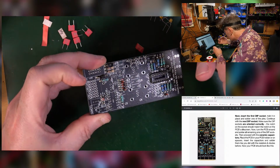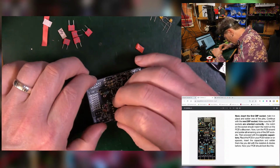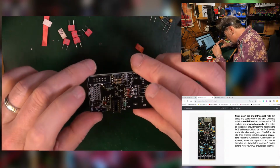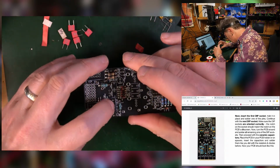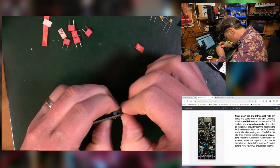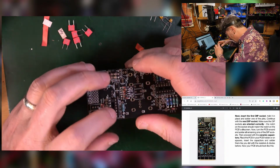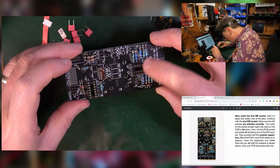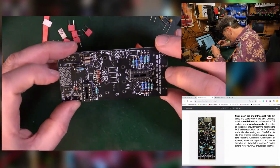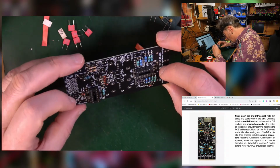They're the same chip, same IC holder. Yep, that's in, there's the nick, that's the front, that's good. I mean, they're not orientated or anything, so if you do put it in backwards, it doesn't matter as long as you put in the chip the right way. It's just to transfer what's on the PCB print to the component. And what's important is that the chip's the right way around.